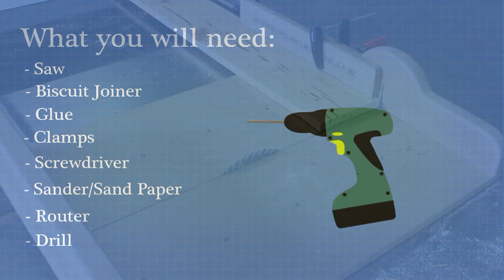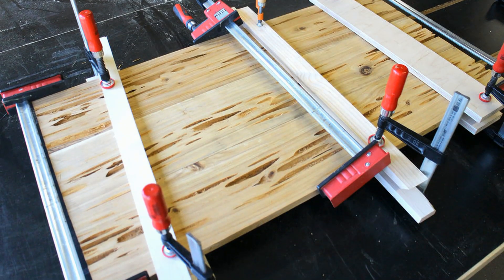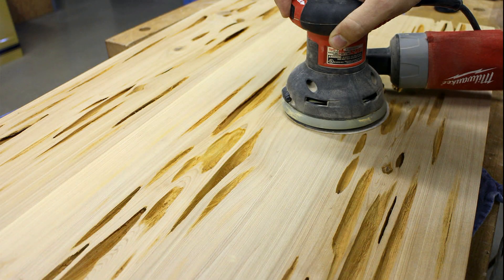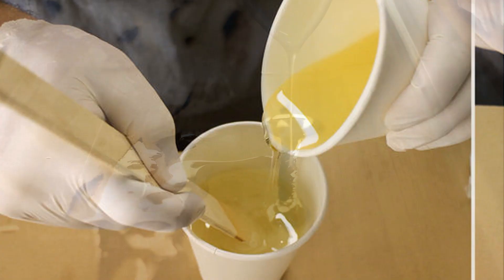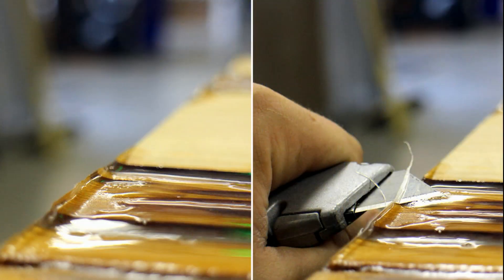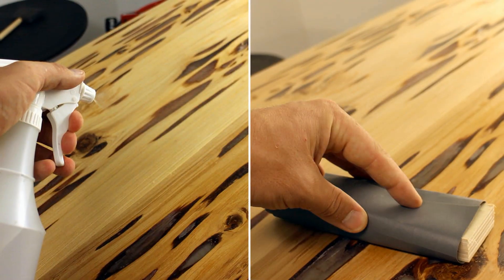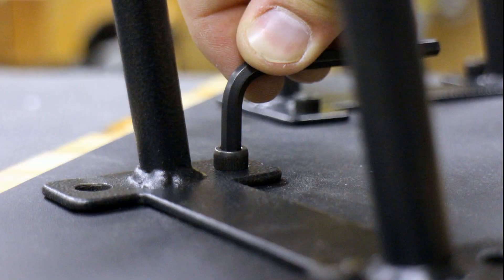Here's a quick rundown on how to make the table. Cut the wood down to size, join the planks together, then scrape, dig and claw out the rotted fungus to prevent the wood from further rot. Sand and mask the table for the resin. Mix the resin with a photoluminescent powder and pour the resin into the cavities. Test the glow and clean up the edges. Sand the resin and the table again. Use the router on the edges and then apply a durable clear coat.